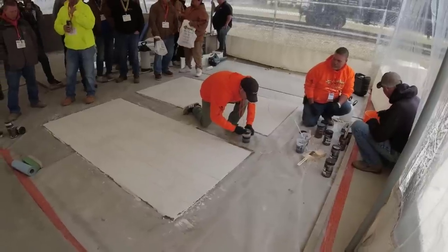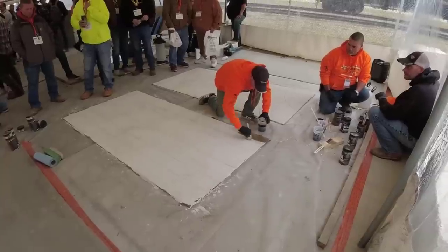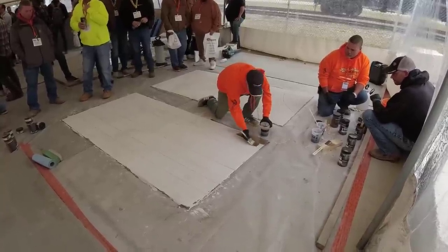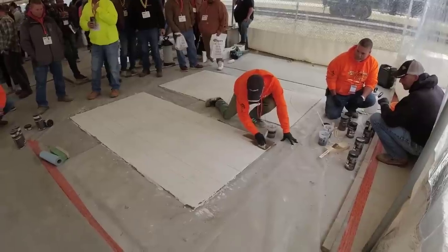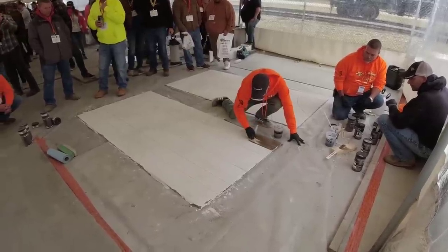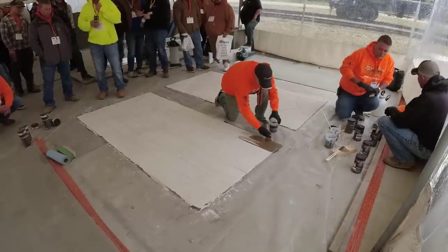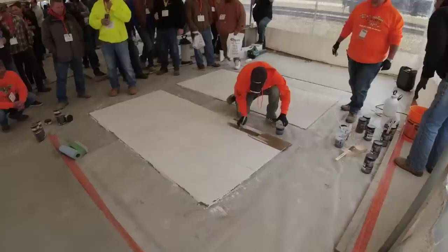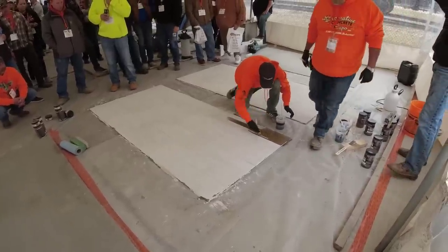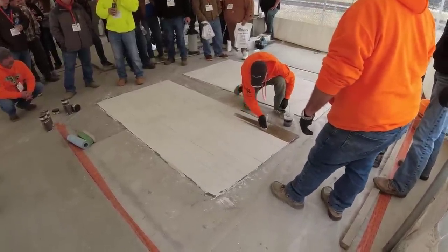So when coloring these wood planks, it's all in technique — diffusing multiple different colors to make it actually look like wood. The overlay they put on was real thin, like an eighth of an inch, put on just with a hand trowel. The technique to get the wood grain is used when you put the overlay on with a hand trowel, and now we just individually color it to make it actually look like wood.